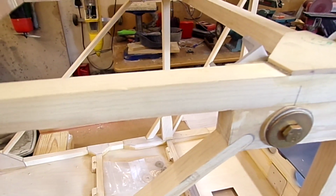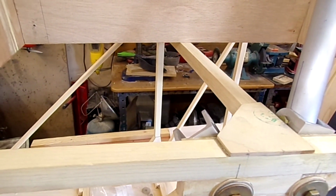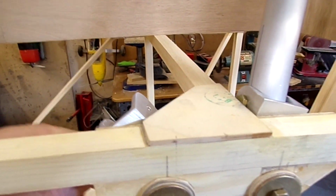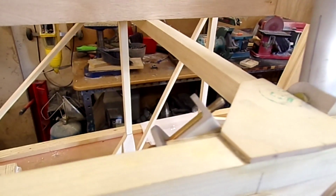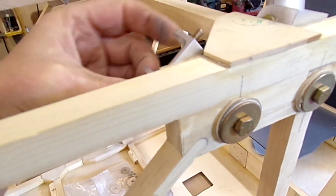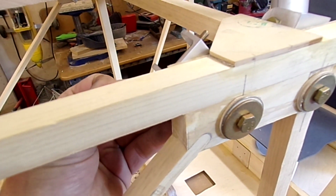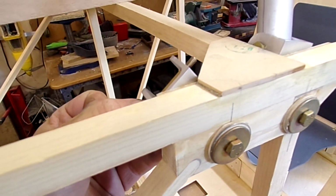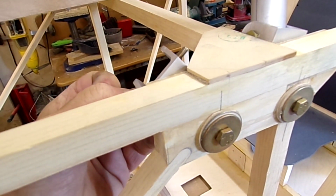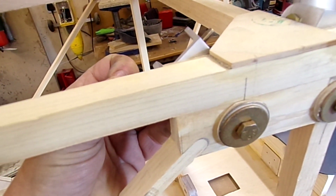So I'm going to end up going to a 15A, and there's still an issue when you go to a 15A, but when you put that through, you've got plain shank going through to the side there, so this will need to have a washer underneath the head, just to put that down to the right position and washer underneath the tail end there for the nut, otherwise we end up with good length of thread sticking through where we don't really need it.